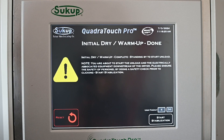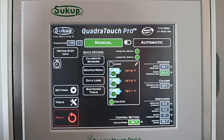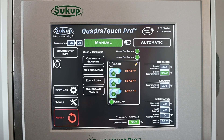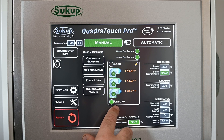Now it's saying we need to push a button before we can go forward, so I'm going to hit Start Stabilization. At this point you can see the fans have all started turning — there's a new animation added in this version of software. The burners are lit; once we see a flame there, that means it is actually sensing flame. We're working on a simulator today so things happen a little faster. The unload system is now on.